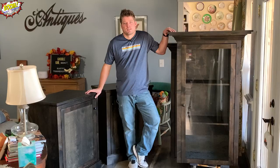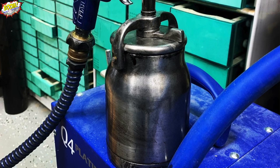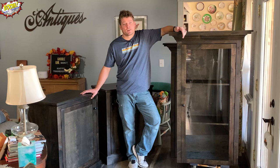The client elected to go with a fairly dark stain, so I suggested ebony and they liked it. Using my Fuji Q4 sprayer loaded with a non-thinned ebony stain and a 1.0 millimeter tip, I sprayed over all of the pieces and let it set about five minutes before wiping it off. Once the stain had cured overnight for roughly 24 hours, I sprayed on a satin lacquer.